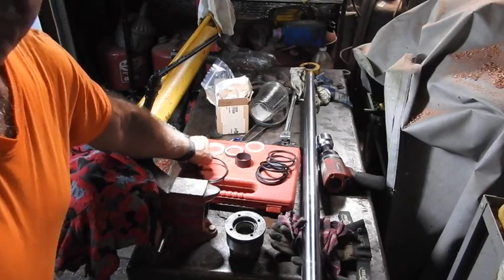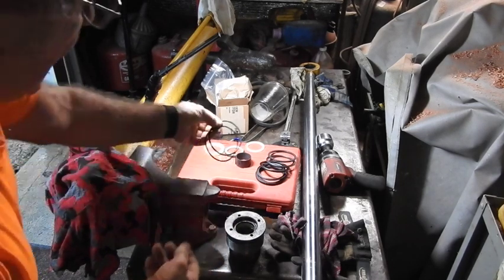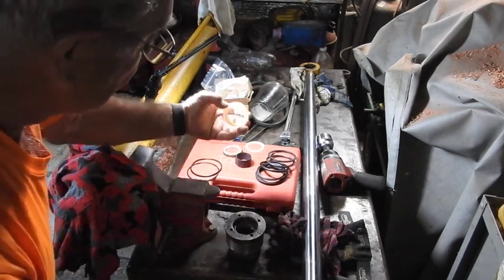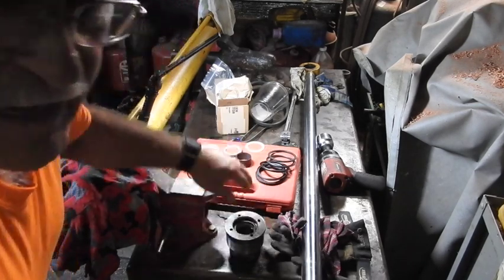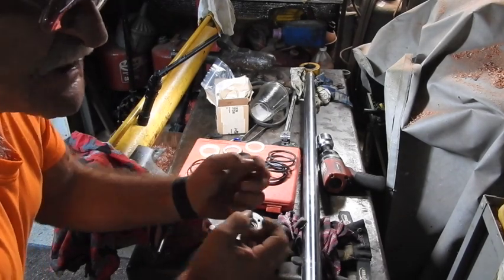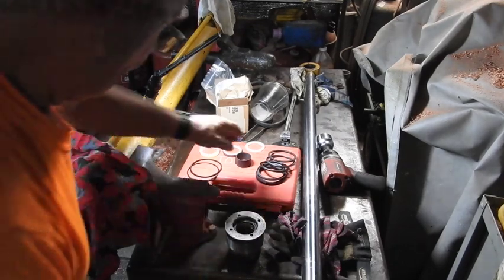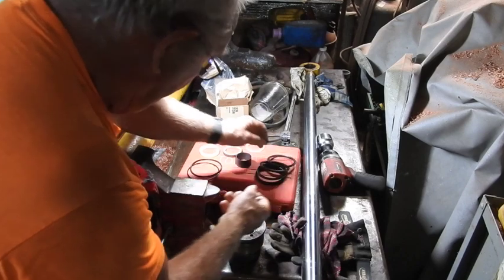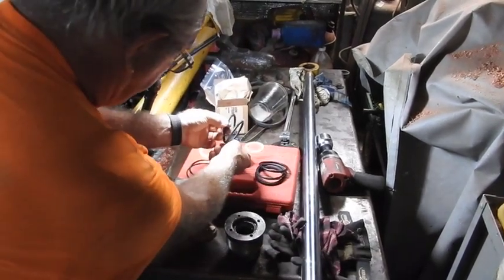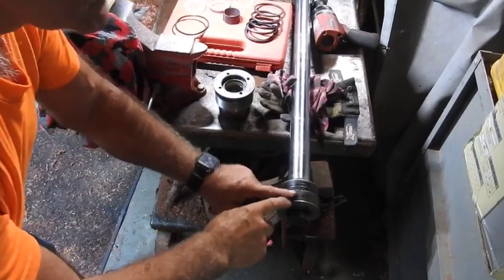Here are pretty much all the components to the new kit. Up on the gland end, we'll have a flat spacer washer, an O-ring, and then a seal. We'll have a wiper ring that goes on the outside and a seal that actually inserts down in the middle — that's a very difficult one to get in because it's got a retention casting it has to go in between. And then these will be the actual packing, shaped like a V. You can see there's a male and a female — an angle on one and a V-notch on the other — so they all stack together and create this assembly.